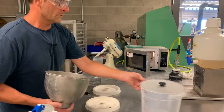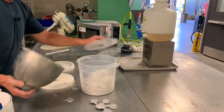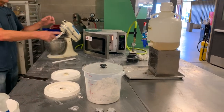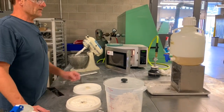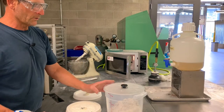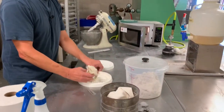After mixing, I'll clean off the impeller and transfer this sodium silicate sand into a covered plastic container. That's so that the carbon dioxide — which is used to react the cold box chemically bonded sand's sodium silicate binder — doesn't cure the binder prematurely from CO2 in the atmosphere. I'm then going to take a little bit of talcum powder and dust each of the mold patterns lightly before adding sand.